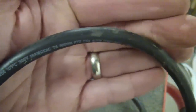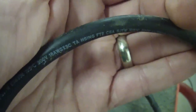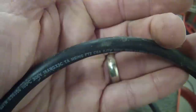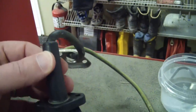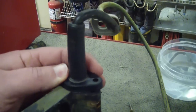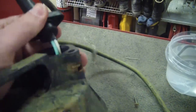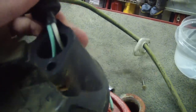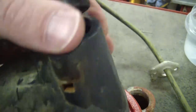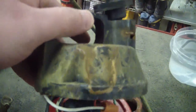We'll start with the power cord, which is a really good power cord — UL rated for 105 and also CSA rated for 105. This is one of the best power cords I've seen on a tool. It's that Ta Sing cord, which was on the Makita hypoid saw as well. We've got a beautiful strain relief, a sealing gland, and a proper metal ferrule to bolt on there. And this is awesome — it's just ABS plastic, that black sewer plastic, but they put in steel threaded inserts so that it would actually work and wouldn't strip out. That is just skookum.